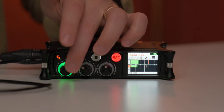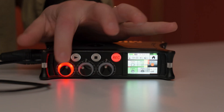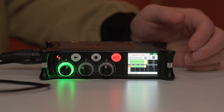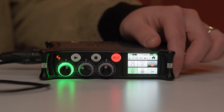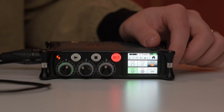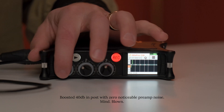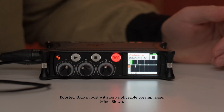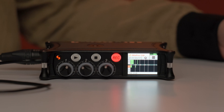Say a toast giver just gets far too excited and their audio is peaking like crazy — we're going to be able to recover that in post. Or say granny gets up and gives a speech and she's talking really quiet, and the levels are just unbelievably low — barely hitting negative 40 decibels. We can recover this information and make it sound pretty good without increasing too much noise. That's the beauty of 32-bit float audio.